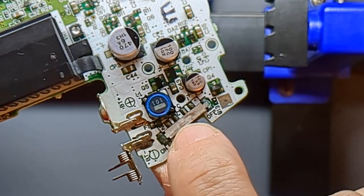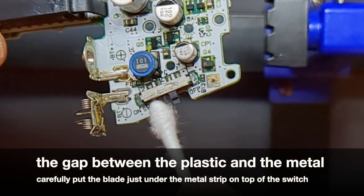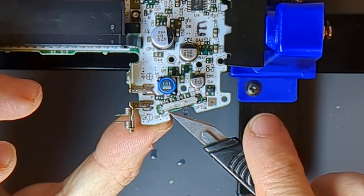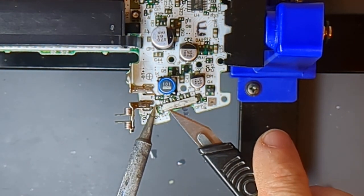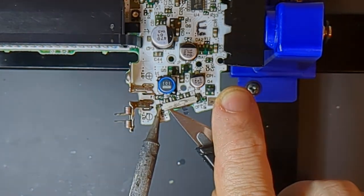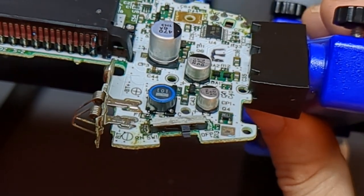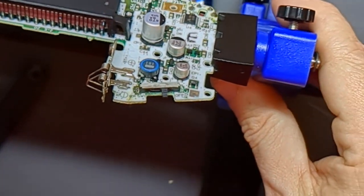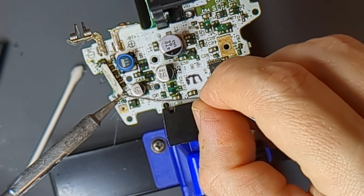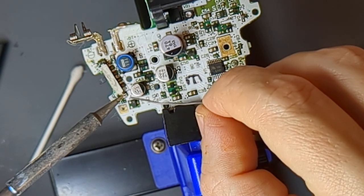I'm going to try and remove this metal casing from around the switch - it's soldered on at two points. If I get a blade in the gap and just lift it off, I should be able to remove that top bit and dismantle the switch itself. My soldering iron is warmed up - I'll apply the tip of the blade just underneath to apply a bit of pressure, heat up that point and try to lift it off. It's been really weird how it won't lift off. Normally when I've done this I've just heated the solder and it's come off, but the corrosion has got in there so much it's hard to get at the soldered bit. I'll try getting some solder to take to it - the solder just does not want to take.